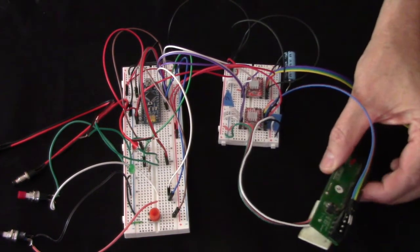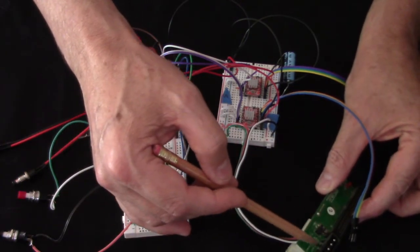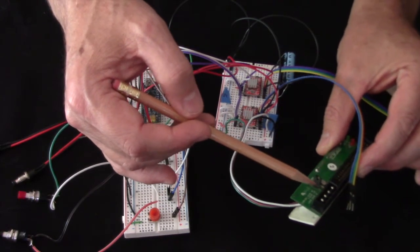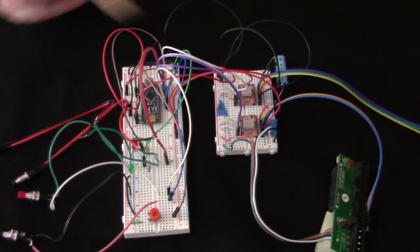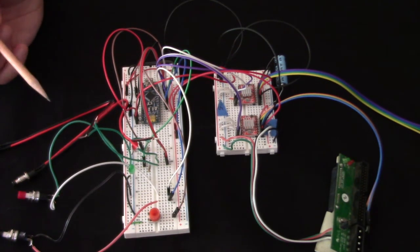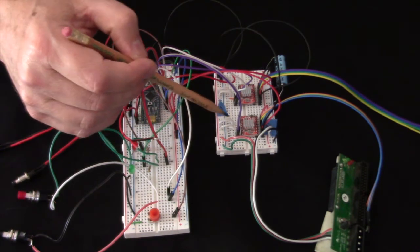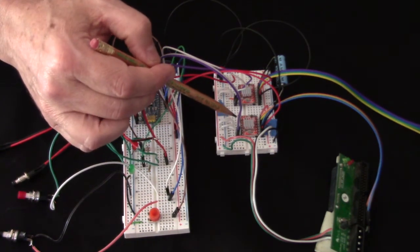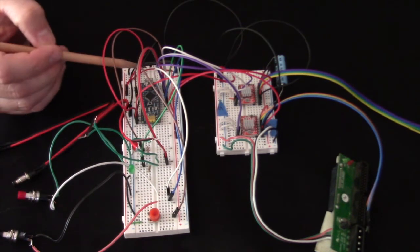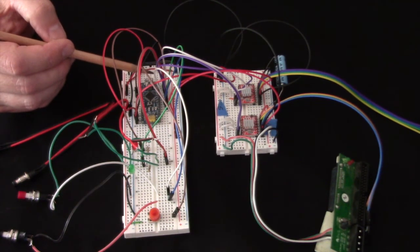And then I've salvaged a connection from an old hard drive, and then I can plug in my standard 12-volt, 5-volt interface right here. So the 5-volt bus will also power the Arduino over here. To control the direction and the step of both of the motors, we have a purple and a white for each of these. And then they come back over here to digital output pins, and we'll go over the pin orientation when we look at the Arduino sketch.